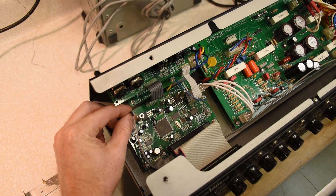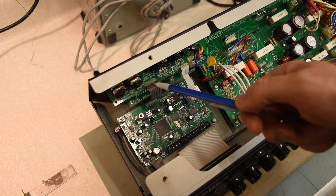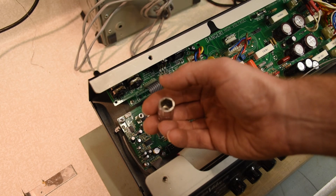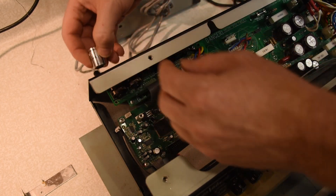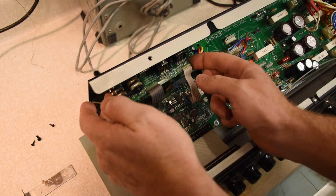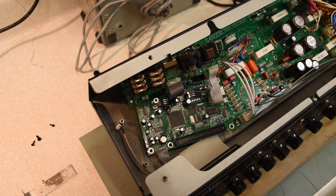I'm gonna pull this board out. Because these ribbon cables are soldered on both sides, you have to pull this board out also. For the quarter-inch input jacks, I made — or modified — this socket. It's an 11 millimeter; 7/16ths would probably work too. I ground down the front so it's flush, because these nuts don't stick out very far. The normal taper on these sockets would sometimes make it slip off, so this grabs a little better. You don't even really need the wrench — you might not even want it, because it's easy to over-tighten these plastic ones and strip out the threads. Pull this board out and this one, and there's one more ribbon cable close to the front input jack. Use that same socket on the front.